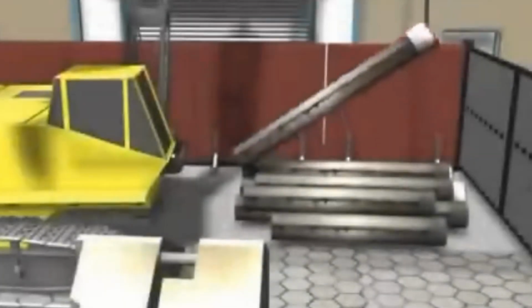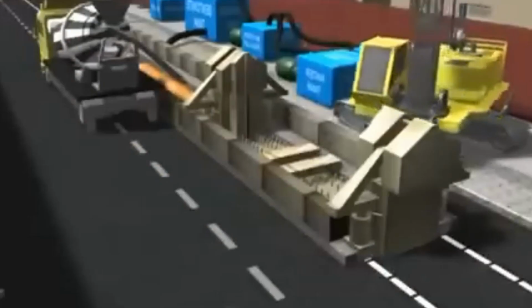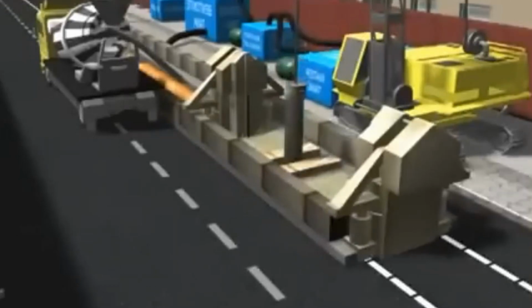Concrete is delivered into the trench through a steel pipe that reaches the bottom of the trench. Usually, 2 pipes are used for a 6-meter wide panel. The pipes are filled with concrete and gradually lifted from the trench bottom so that the incoming concrete displaces the lighter bentonite slurry upward. The bentonite soil mixture is pumped back to the processing plant as it is displaced.